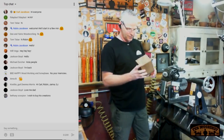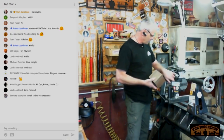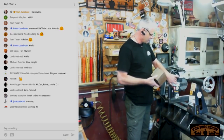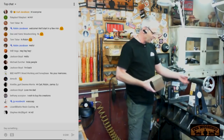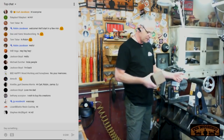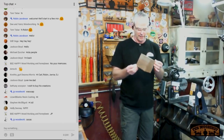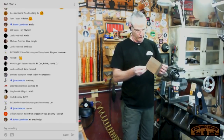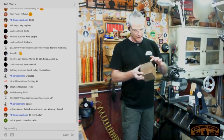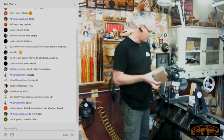All right. So this is Walnut. I'll switch cameras here in just a second. So what you want to do is take your spur center out of the headstock. It's going to go right in there like that. At my live center here, I pulled the pin out of the center of it. So you basically just pick two of the points. I have a little bit of a crack right here in this one, so I picked these two points so that when we're done, these points out here will be left and we'll get rid of that crack, hopefully,